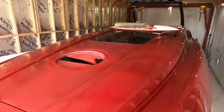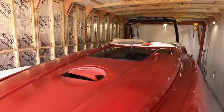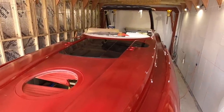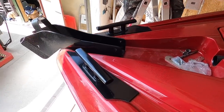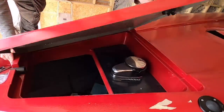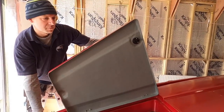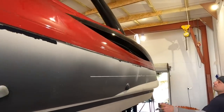We've got the glass pool deck with hatches in, which will make a really nice light feature in the cabin below. We filled in one existing hatch and put glass in for the detail, kept another because we tweaked the layout inside. We've been able to fit some new deck hardware — all in black — and put the rubbing plates on to protect the paint. In the anchor locker we're fitting a new windlass, and all the flow coat is in to make it look brand new.